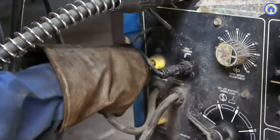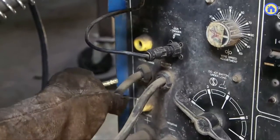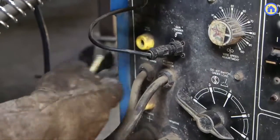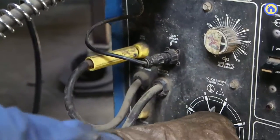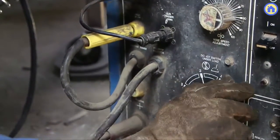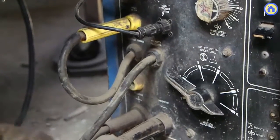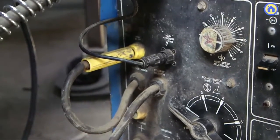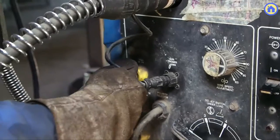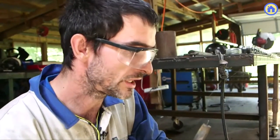There's a high and low side on the welder. The low side is 10 to 20 volts, and the high side is 20 to 30. We never really use the low side here, but on the high side we go from settings 1 to 6. At 6 you can easily weld half-inch or even 1-inch metal. At 1 you might want to do one-eighth inch or very thin metal, and on the low side you can even weld very thin sheet metal or bandsaw blades.